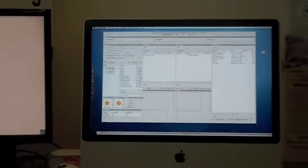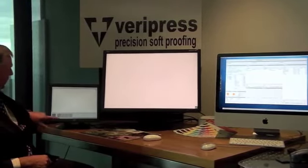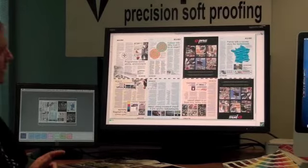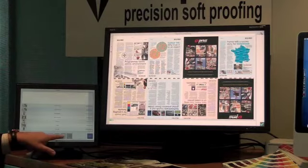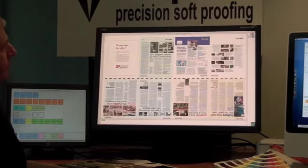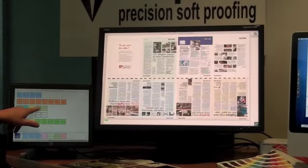The jobs are finished processing. On the touch screen console, the press operator simply presses Home, then Publication, and selects the last job and presses View. The large eight-page section is programmed to fit the width of the screen automatically. Since we're on a perfecting press, we load the job again to show both sides — front and back — on screen. Using the Previous and Next tab buttons, we can switch from one side of the press sheet to the other.